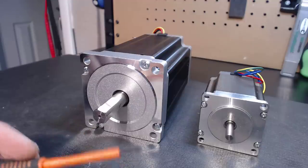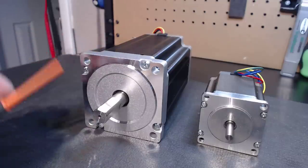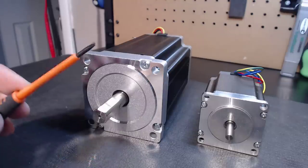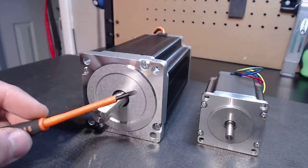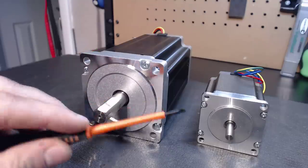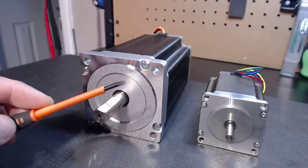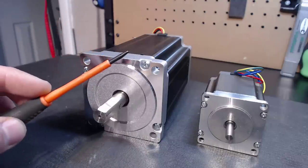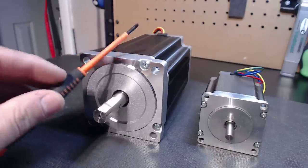When you message me, if you do have questions, please ask. Don't make an assessment based on buying a large motor you may not need — because you end up wasting money and there's no reason to do that. Take your time. If you figure out exactly what chassis you're working with, selecting a motor will basically fall in line with a lot of the chassis already on the market. If you're doing a full-scale retrofit — Bridgeports and so on — you may even be up to a NEMA 42 standard, but with technology the way it's expanded, you typically will not need a NEMA 42. A NEMA 34 can easily put out most of the torque required for one of those systems — I've done it many times.